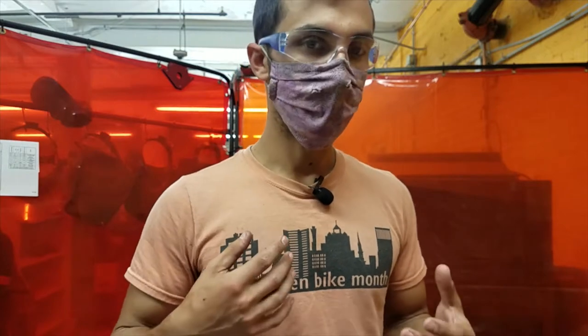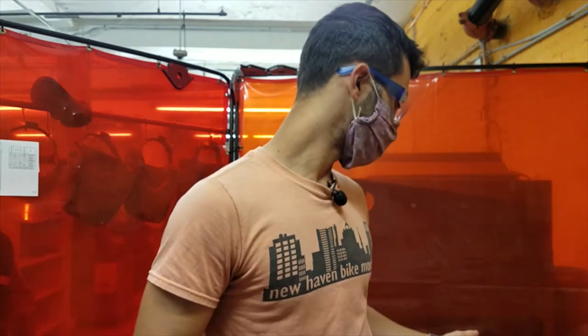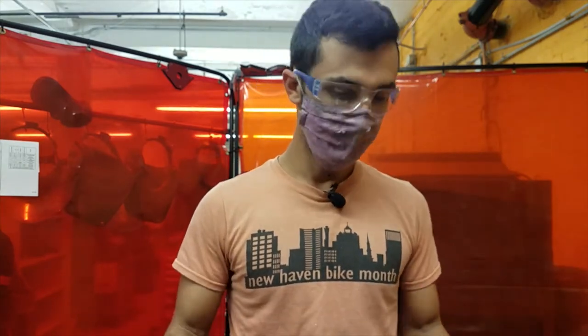The yellow machine is our older MIG welder and the blue Miller Matic 211 behind me is the newer one — higher capacity and higher quality. Luckily, most MIG welders are pretty much the same in terms of how you use them: set the voltage, set the wire speed. This one also has the auto-set feature as a nice bonus, but in terms of how you actually use it, they're fairly similar.